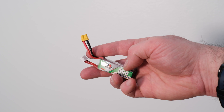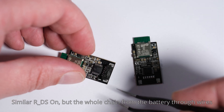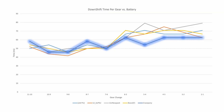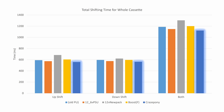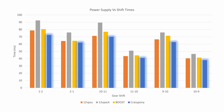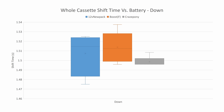The wireless power unit is supposed to be a whole no-compromise situation — starting from lithium high voltage with much higher current levels, a motor controller that is almost an order of magnitude lower in inline resistance when driving that motor, and shortened wires. All of these things lead to greater performance. In previous videos, I used high-speed footage as well as an oscilloscope to measure how long a shift actually takes, and these lithium high-voltage packs made a significant difference. You should look at this as not operating outside the EPS limits so much as removing the limits that were inherent in the system to begin with.